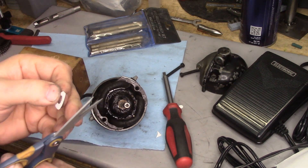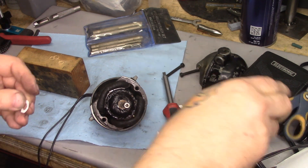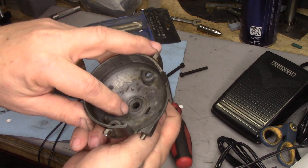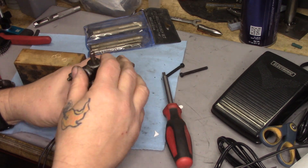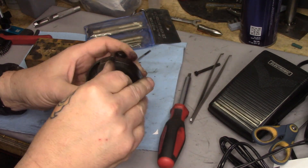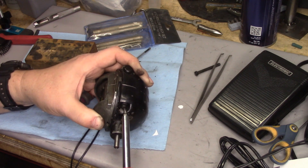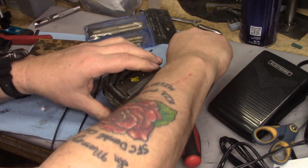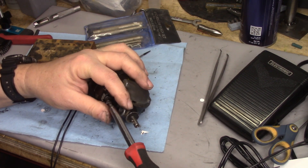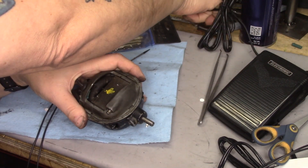I'll initially trim it a little large. This doesn't have to be pretty — this is not going to be acting as a bearing surface. Put a second one here and close it up. This is just taking up some slack. With this back together again, there's like almost zero end play — I feel quite confident that this 'cheat a little' approach is going to work out. I'm just taking up a little end play with cardboard spacers. The fiber washers used in motors are a paper product as well, so I really don't see the harm.